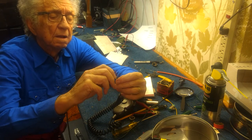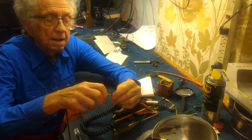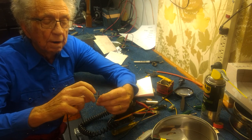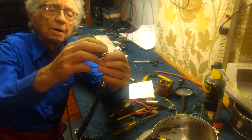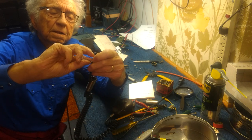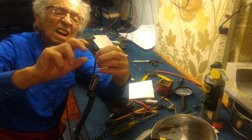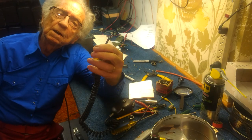Unwrap this wire shield. Hopefully you will discover that this is real metal wire - it's not that cotton-covered resistance wire that won't solder. If it won't solder, you might as well figure on doing a crummy job of wiring or find another microphone that has real wire in the shield. Here is the white microphone wire and here is the shield that I have unwrapped. Hold the three wires and twist that shield - make sure you get all the little fine wires together, then twist it so the shield has become a wire itself.